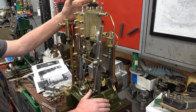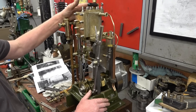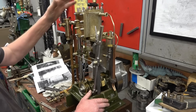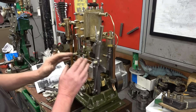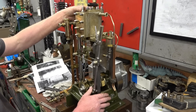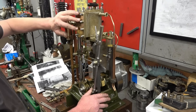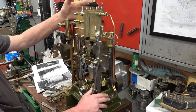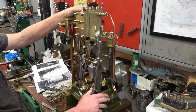I had it at the steam rally last weekend and I had it running off a friend's Robey steamroller boiler. The trouble with running these engines on live steam, apart from the oil everywhere, is that the water condenses inside the cylinder and inside the valve chest when you're finished using it, which means you've got to run it on air to flush all the water out — I don't want it corroding inside.